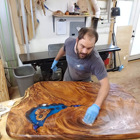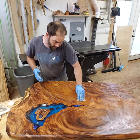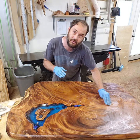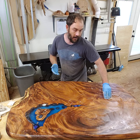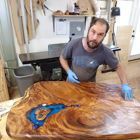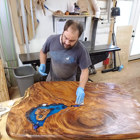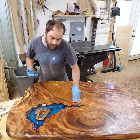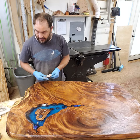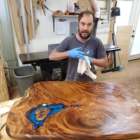You can see I'm not wearing a mask — there's a little bit of highly refined mineral spirits in this, plus oils and waxes, all listed in the ingredients. This company is rated in Germany as child's toy safe — so kids could gnaw on it once it's dry. Once the solvent has dried out in those 12 hours it is safe for kids' toys. It's not rated in the United States since it comes from Germany, but I tend to trust that. It feels like a pretty safe finish. I have it on my countertops in my house and they do really well with moisture — moisture goes in and comes right back out, and it's rated for stains against soda, wine, and all kinds of things.